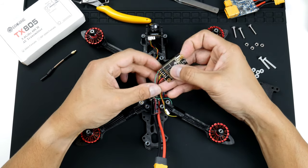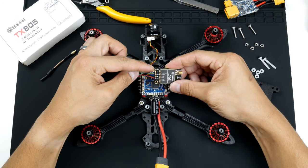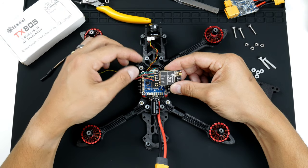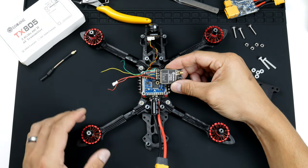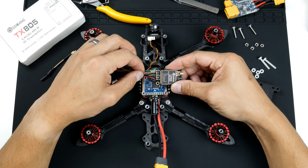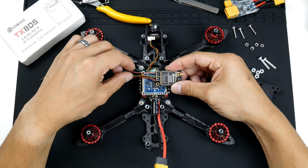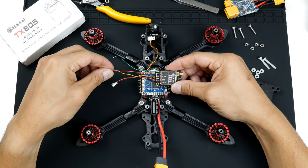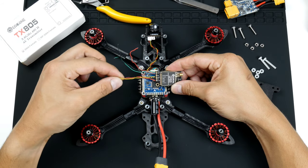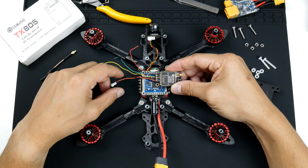It has smart audio, so you'll see here are the wires for it. Smart audio allows you to control the video transmitter settings via the flight controller through your goggles. It also has a 5-volt output for the camera that you may connect to the transmitter, and also a ground. We won't be using those two, so we'll be cutting them off. Here's the video in that comes from the flight controller into the transmitter to send out the signal.